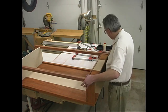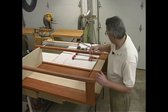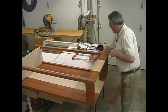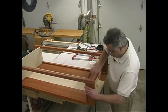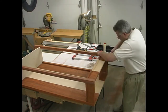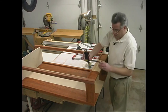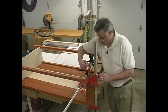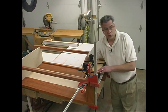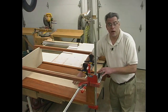We'll bring all the pieces together carefully since we've got those biscuits and need to get the front apron up into the dado. Make sure all surfaces are good and flush along the bottom edge, then start clamping everything together. I'll check it for square by laying a framing square inside this area and move it if needed, then let the glue set up and move on.